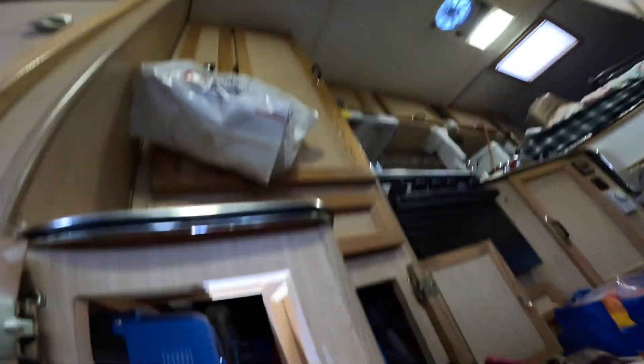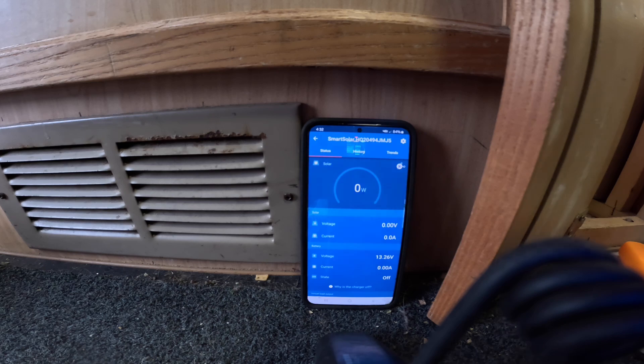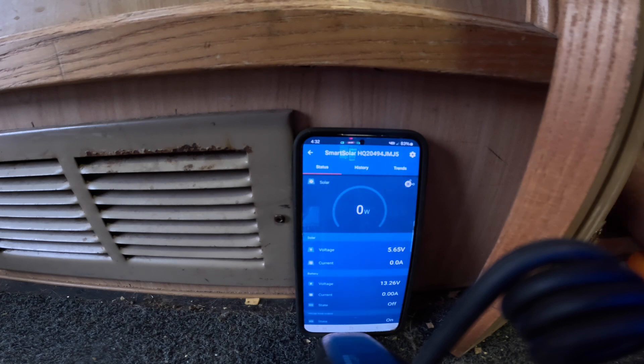Let me set the camera on the tripod and get right up there so you can read the display. Let me start putting a couple of fuses back in to see if we start seeing some solar power. The voltage jumped up to 20.8V, but of course it's 4:30 on a cloudy day, so I strongly doubt we'll see much solar activity. Let me plug in fuse number two.